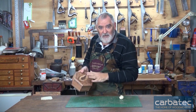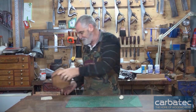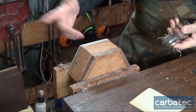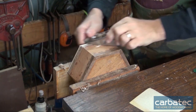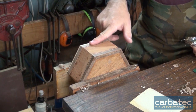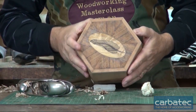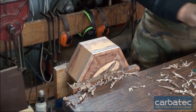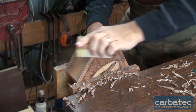Let's go over to the vice. Normally I put water in the vice but in this particular case because I've got inlay and I've used hide glue, I'm not going to do that. Where I've torn out here, that's fine at this stage because I'm going to cut that back later. I'm taking it down to within about a 64th of the sides. That's starting to look pretty good. Cork block, plywood face, 100 grit, and now just give it a bit of a sand.